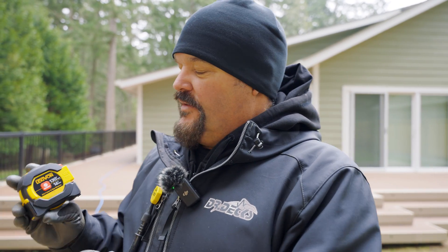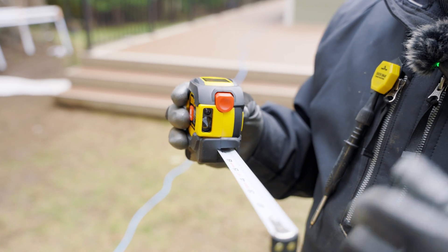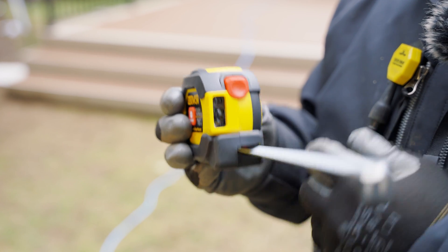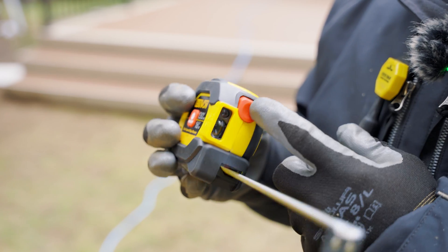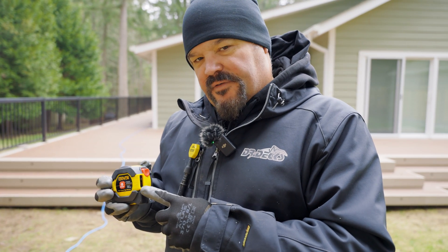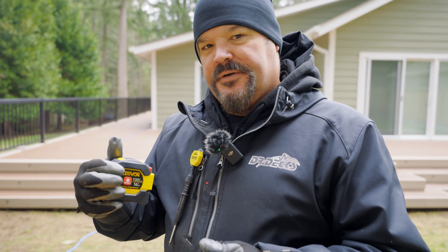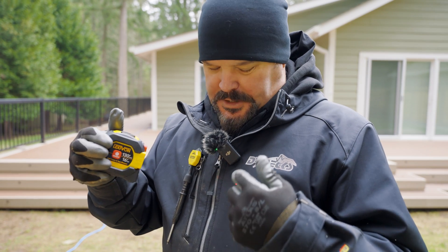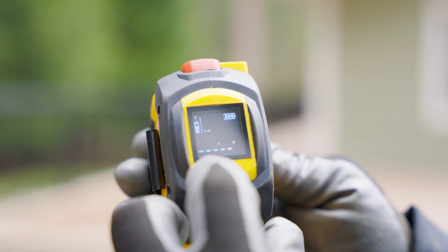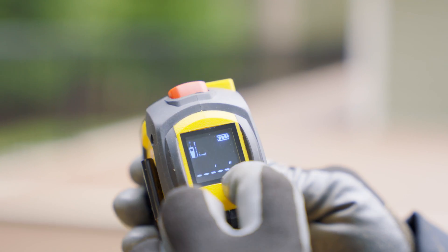There's an on-off button right here on the side of the tape. It looks like this tape is split into two parts — the actual tape is narrow because it takes up about half of the cavity of the tape measure, and then the other half of the cavity has the laser part and the on-off button. When I turn this on, there's the laser — you can see it on my jacket. Don't look at it. Then there's a readout. We've got a good battery; it's ready for us to extend the tape and it's going to tell us the distance.